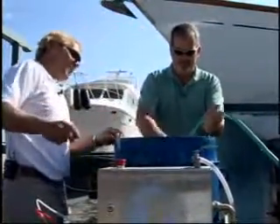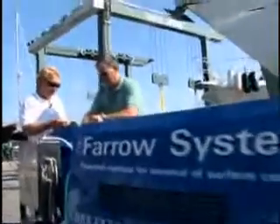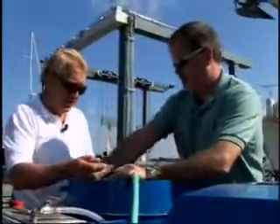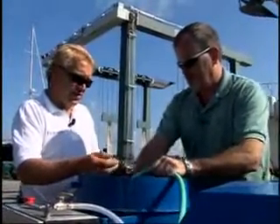There are four nozzle types: green, blue, orange, and red — green being the finest and red being the coarsest. What happens with the size of the media depends upon the surface. If you've got a finer surface, you would use the green or the blue. Today we use orange because it speeds it all up.